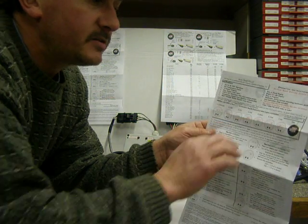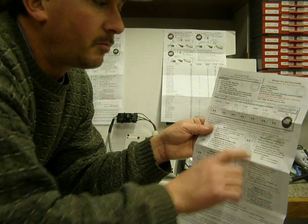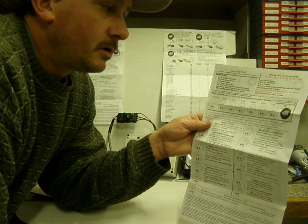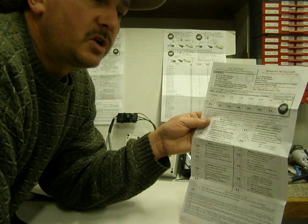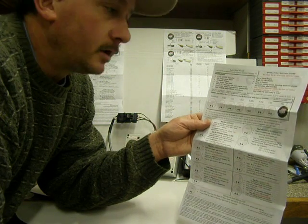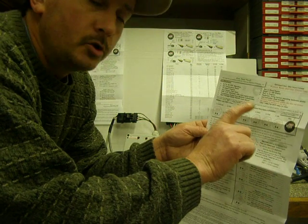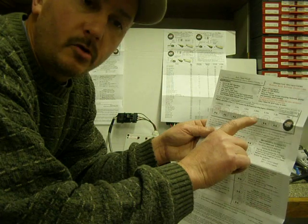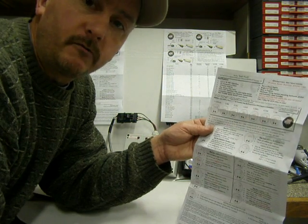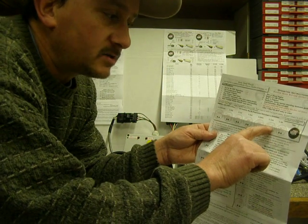The type 0 and the type 1, you'll notice there's two numbers. The type 0 is for a dump valve configuration or with reverse. Type 1 is for a forward reverse configuration only. So what that means is normally open outputs, normally closed outputs. That's all that is. That is the number one problem that everybody calls in. They get in the program, they goof that type setting up.